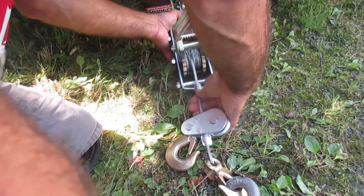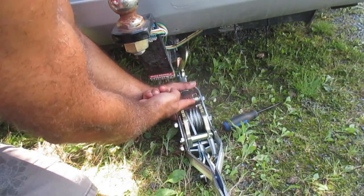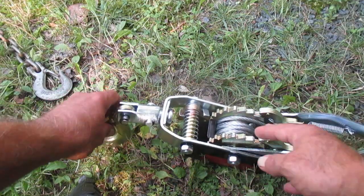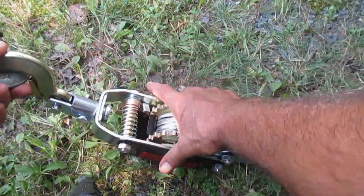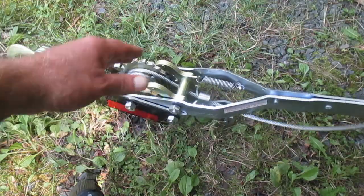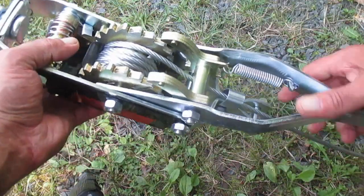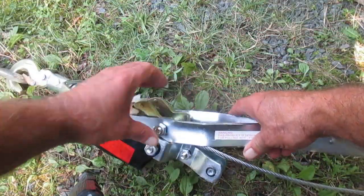I'm going to keep that other pawl and push forward — hopefully that's coming out. I got this pawl off of the ratchet by doing that. See that pull through. To get the cable back onto the ratchet, hook your anchor end onto something solid. I've got all this cable out here — just lay that out. We're going to re-engage the ratchet; push that down.